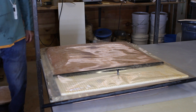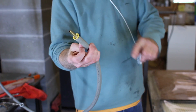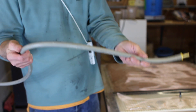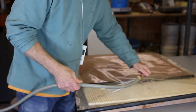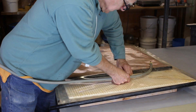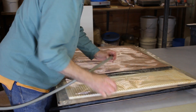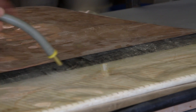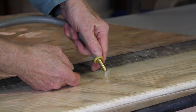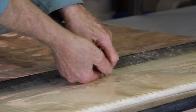To get a better detail on this — this is simply a hose fitting that has been turned off smooth, so it's got a hose barb in here. This is ordinary compressor hose which you can get at Home Depot or Lowe's or any place like that. This is a plug. It goes in here — this is vulcanized onto here and it simply presses in. Once this goes under vacuum, it will seal itself really tight.